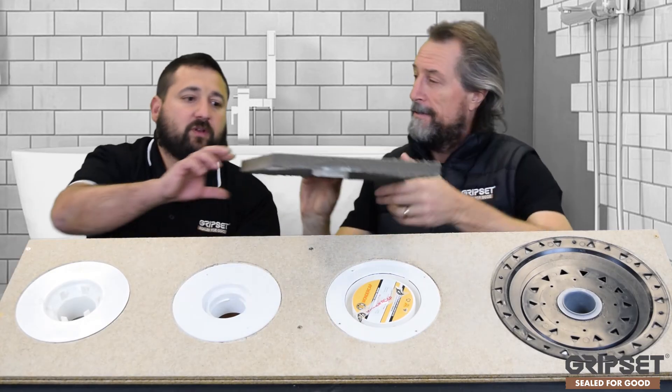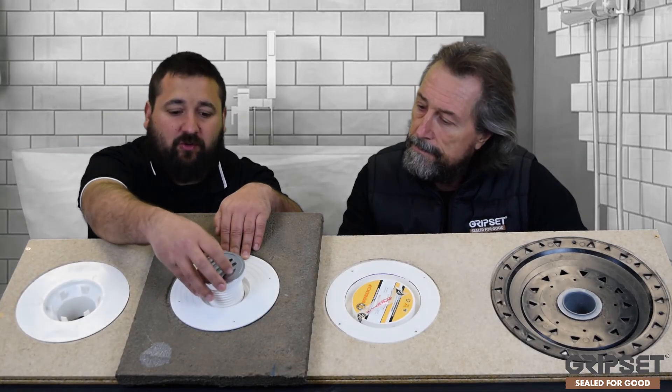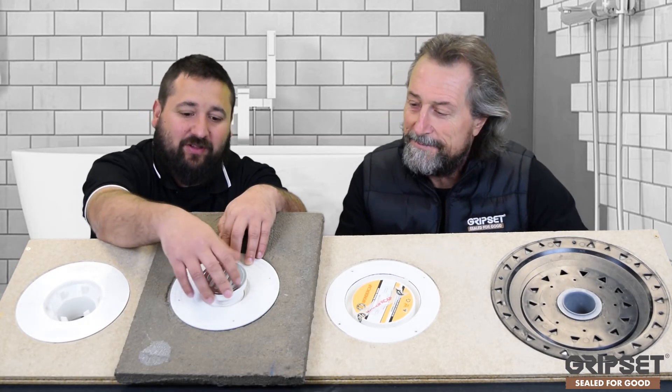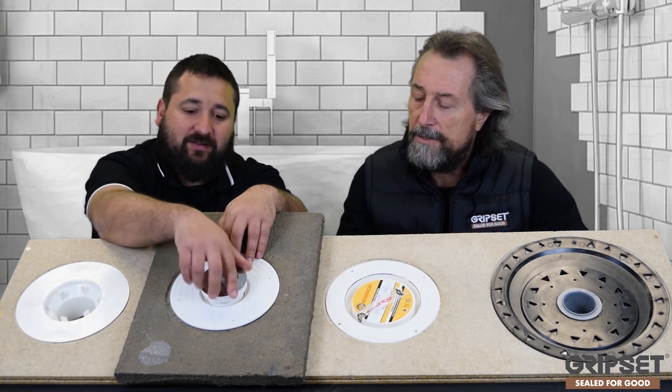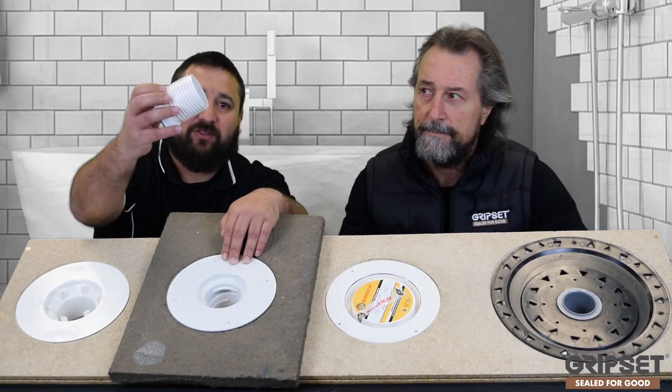This gives everyone peace of mind that that joint is bridged and reinforced. Our systems are all about time, but never at the compromise of the end job. Whether you're using a screed on any of these systems, you've got to use the flange over and under — not one or the other, both. The screw-top flange is a favourite of mine because it's adjustable — you can incorporate it right through, allow the toilet pipe all the way down, and have that continuous connection without compromising the strength. The limitation really is the size of the thread.